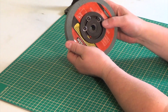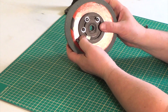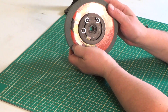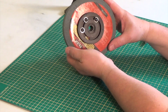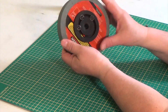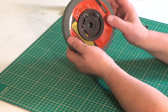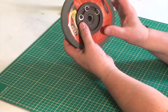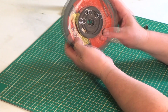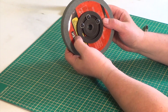This is a half-inch hub, made for a half-inch spindle bench grinder. Once you have this balanced, you now go to your bench grinder and install one wheel at a time. Since this is the right-handed thread, it'll go on the right-hand side of your grinder. Install the wheel and then try your bench grinder.